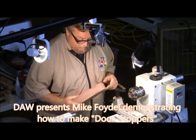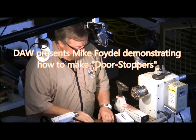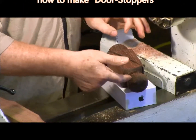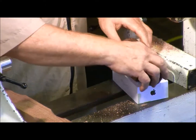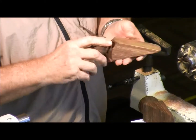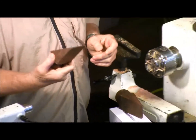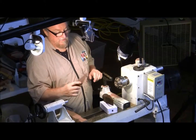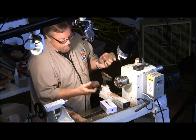You take square wood like a two-by-two, turn the ends as fancy as you want on the lathe, then take it to your bandsaw and cut it on a diagonal — these make great door stops. I give them out as presents. The ones in hardware stores are all rubber and junk, but at my house I've got a couple doors that ride a little high and miss those kinds, so I put these down and they make a nice door stop.